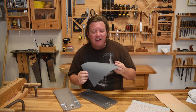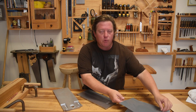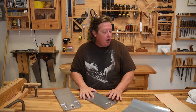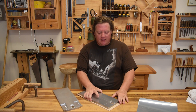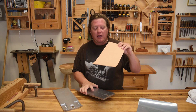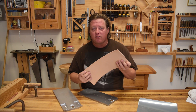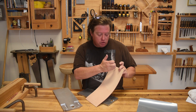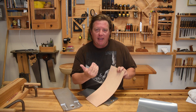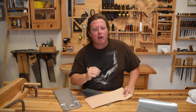I'm also including a 0.5-micron sheet, which is about the equivalent of a 9,000-grit water stone, which is a polishing stone — that will be the final step before you go back to work. We also include an oversized leather sheet so that you can place it on the back with adhesive and cut it down. If you're like me, you'll just have the entire back on the smooth side, because that's really all I use. A lot of people like something a little rougher that they can put rouge on and prefer the back side of it. Some of you will be smart and split the sheet down the middle so you can have a rough and a smooth side — one side for rouge, the other for straight polishing. Either way, you can set it up the way you want.